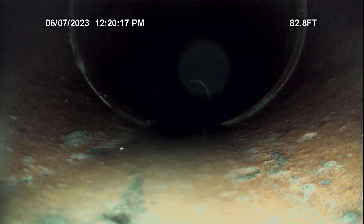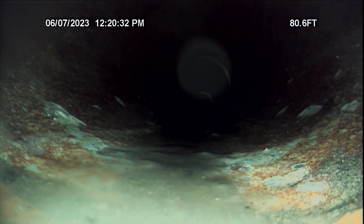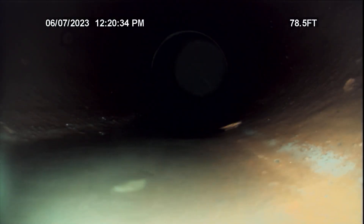We're in the six inch line right here. This line has a large amount of sludge built up in it. I'm trying to cable through the toilet flange but no effect because I had to move through the jetting line. It's only about 80 feet out. You can see the water is at the very bottom of the pipe. This is all six inch right now.